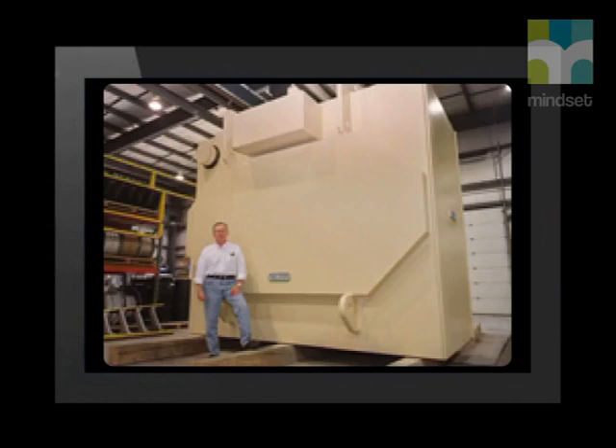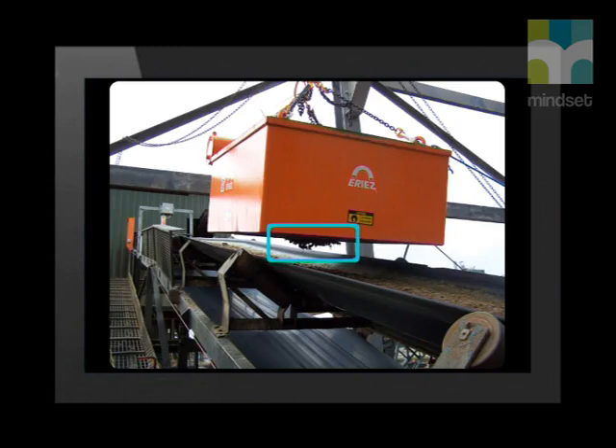These days, companies can make very large electromagnets. One of the largest was manufactured by a company called Walker Magnetics in Canada. It weighs approximately 88 tons and has approximately 270 tons of lifting capacity — the same as lifting 130 taxis at the same time. This electromagnet will hang above a conveyor belt and pull iron and steel material from copper-bearing rocks passing beneath it. The ferromagnetic objects could be anything from workers' tools to chunks of metal ripped from machinery during mining operations.